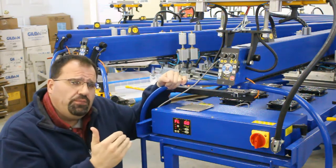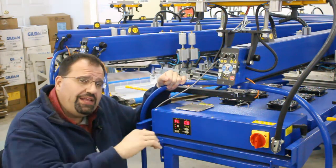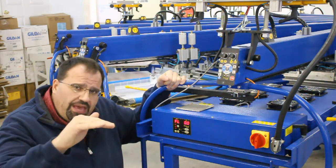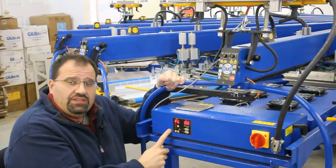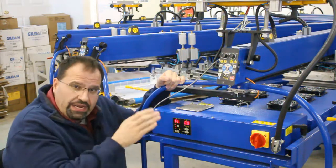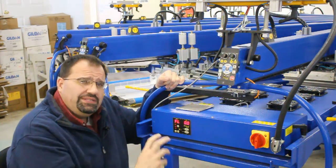I think the vision for Printex is to be able to tie together the functionality of the flash with the control and then create an algorithm that will allow the machine to automatically make those adjustments that you normally make by twisting knobs. The control itself obviously has zone control, so you can control the different zones for small, medium, and large printing. You can also control the time as well as the power intensity.